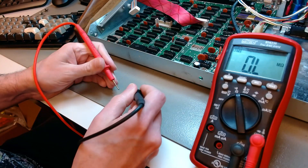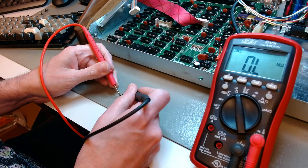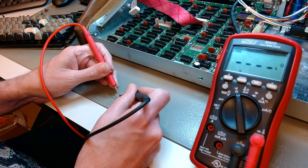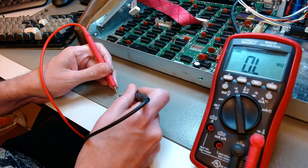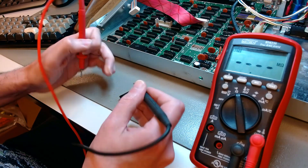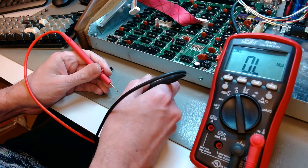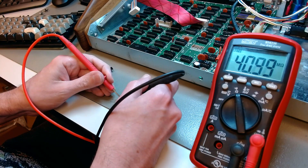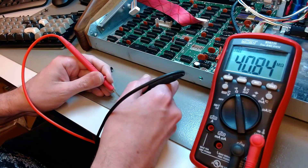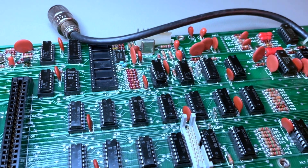This is one of them — the one that brought the impedance down by 4 ohms. If I measure the impedance from VCC to ground on the old chip, I get 2.8 kilohm. That's fairly low. To give you a comparison, let's measure a brand new chip — the same chip, but brand new, just taken out of the package. We have 41 megaohm impedance from VCC to ground. So although this chip actually passed the logic test, it should be replaced.